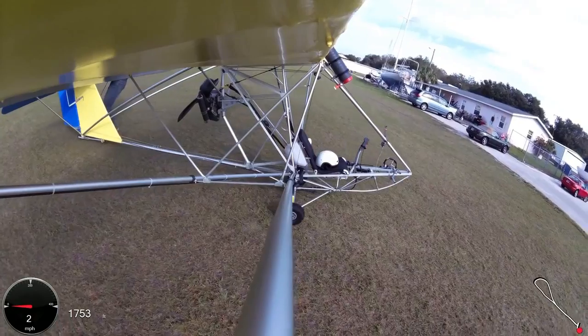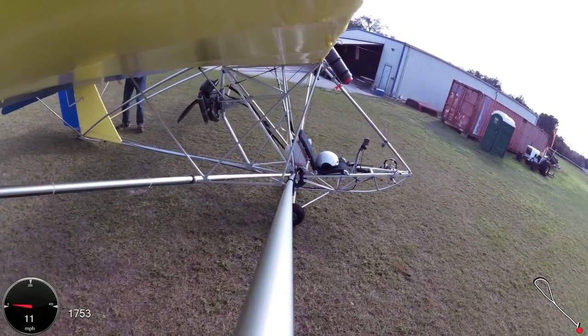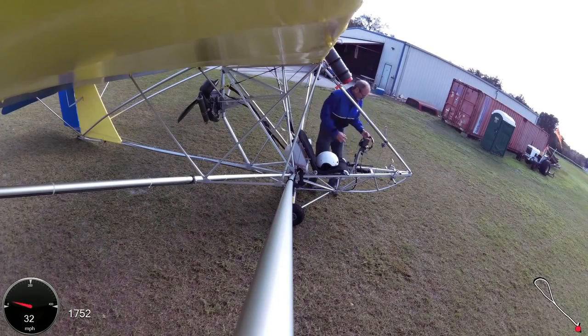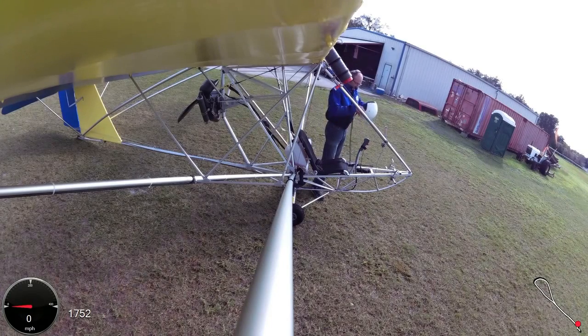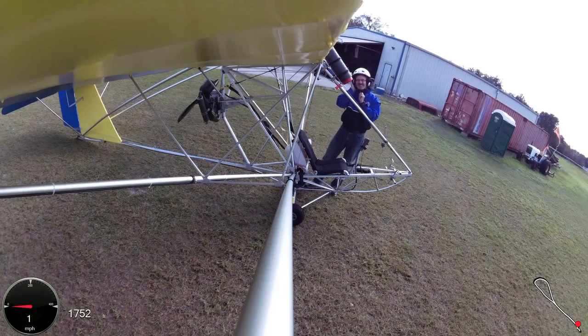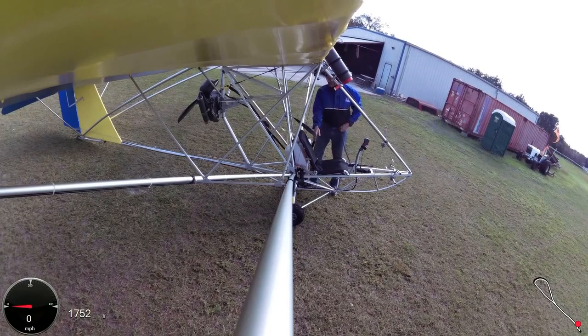If it's a kit, how long is the build time? It's 100 hours. I built the airframe and the wings — everything aluminum — in 100 hours the first time, and then had to cover it. So I think 150 hours is reasonable. But even then, if you're off by 50% it's just an extra week — no big deal, it's still a very low-time kit. For the guy that says he doesn't want any part of that, you'll basically ship them one in a crate — some assembly required. The assembly manual will be pictogrammed. Take it out of the crate, lay it out, and follow the pictogram like you're building that Ikea desk. Here's the tools you need, step one through five, and it's done — an afternoon.